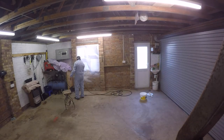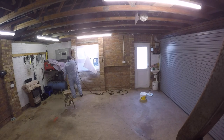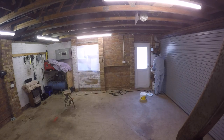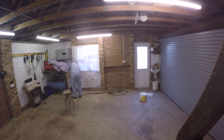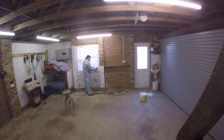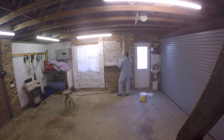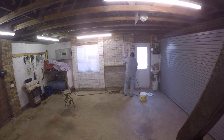I've got the compressor running and I've hooked up my spray gun and filled it with masonry paint — basically white emulsion paint with sand in it, I'm guessing. It's textured masonry paint that you'd use on the outside of your house. All I've done is diluted it about 50/50 with tap water, mixed it up. It's still relatively heavy in consistency, but that means it doesn't give an awful lot of overspray, which is pretty good for this application.